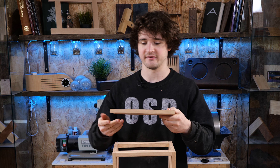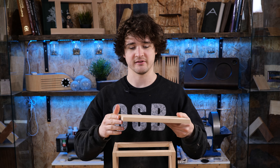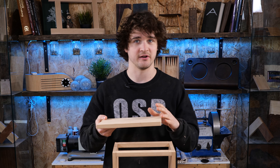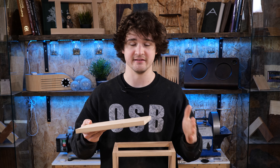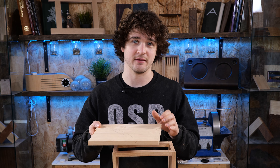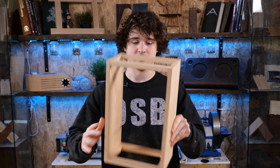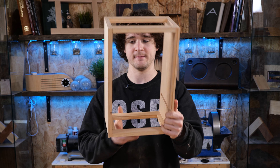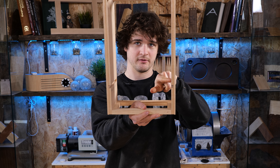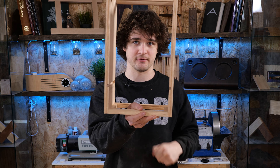The only thing I would like to remind you is we're going to be cutting a tongue on the end of this to fit within the groove of the carcass, and effectively that is a type of tenon. A common problem is that people cut the piece to the distance between the shoulders without taking into account the added length they need for the tenons. In this cabinet, you're not cutting from here to here — you're cutting from the bottom of that mortise to the bottom of the other mortise. So make sure you take that measurement and not the measurement from the inside walls.